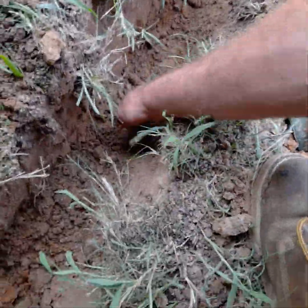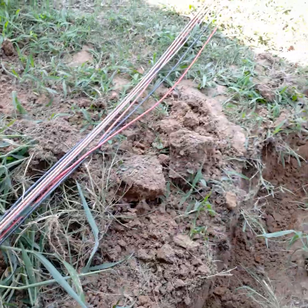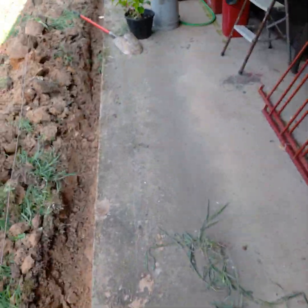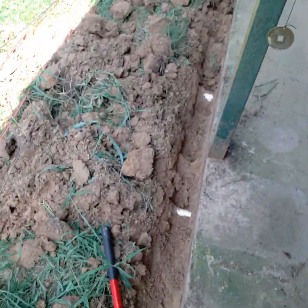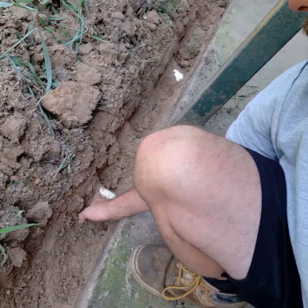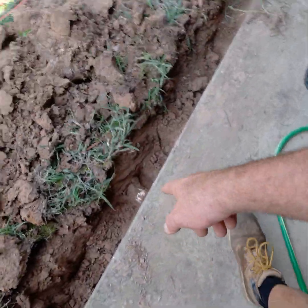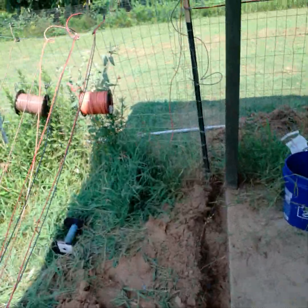We had to be careful of the septic lines and things of that nature. As you can see, we have a cap here — there's an obstruction over there, so we had to cut across pretty tight. We come over here and have other lines. This is the reason why I prefer to hand dig everything that we're doing, because if you're using a machine you can't feel that. Thank God those didn't get busted — that one goes to the sink, that one's probably from a shower.